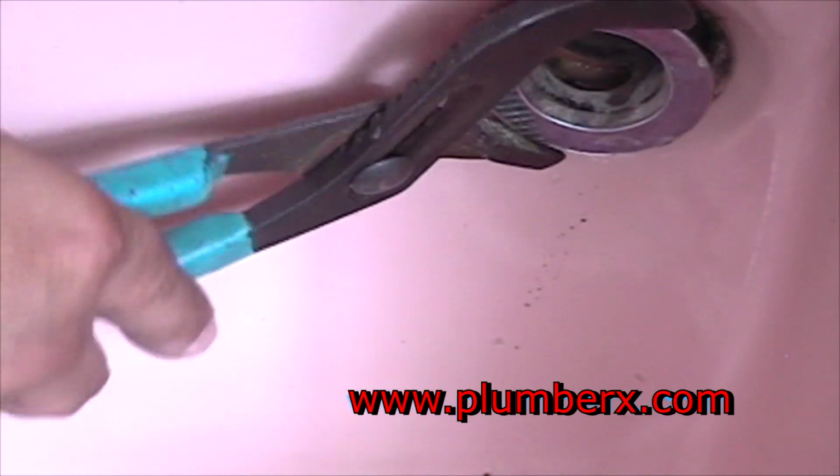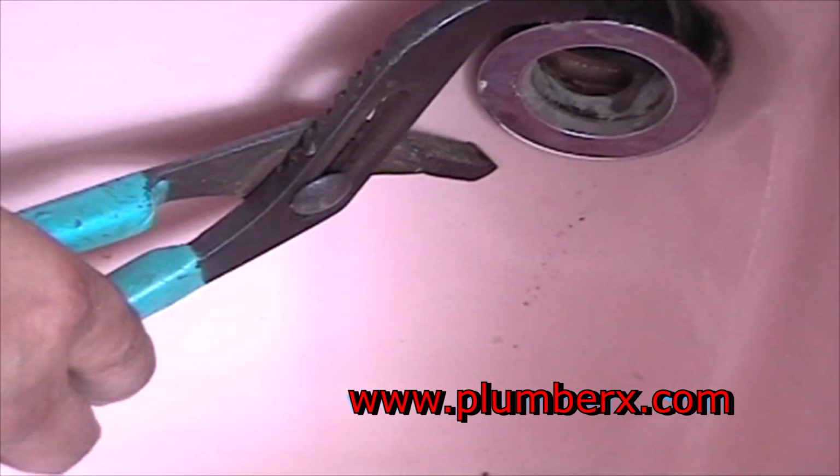Okay, now we've got the mounting bolt back up flush to the sink, and now we're going to look on the other side, and you'll see what I was talking about to give us the space that we need to disassemble the top of the pop-up. Now you see the space that we have? We have space to get our channel lock pliers on here. And we're going to continue to hold it on the other side of the sink while we take our pliers and screw this top part of the pop-up off. And then we can pull the pop-up assembly through.